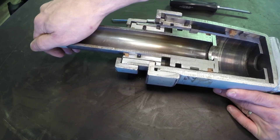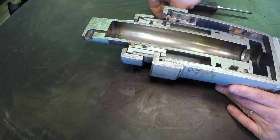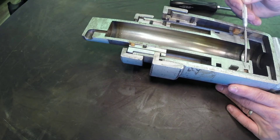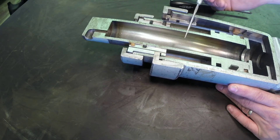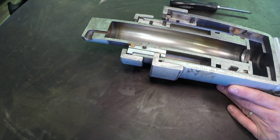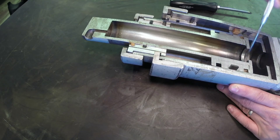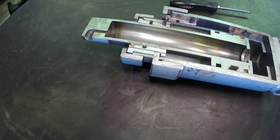What we see in stage retraction is really some of it having to do with overall friction in the cylinder and the path of least resistance — whichever one is easier for the oil to travel. The greater force from the dump body will be able to move this small amount of oil quickly. So really a lot of it has to do with friction on the retraction side as well as just the path of least resistance for the oil flow.